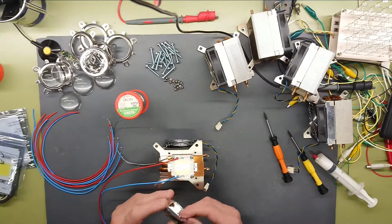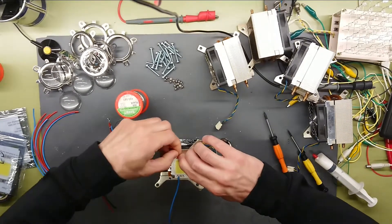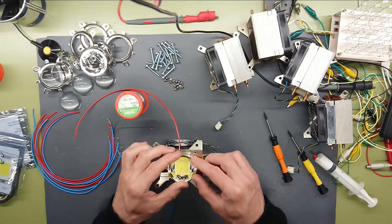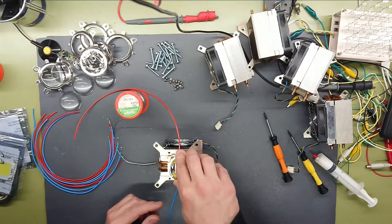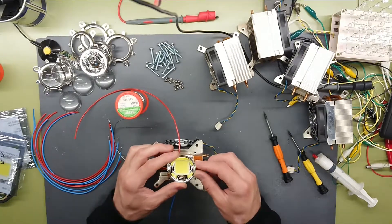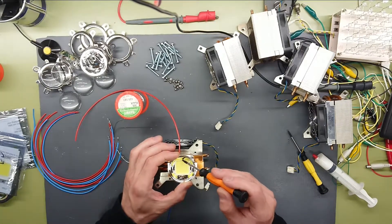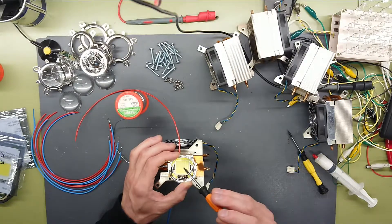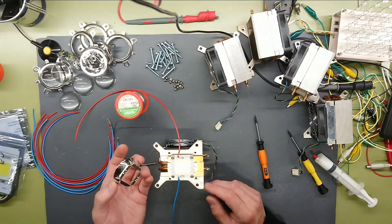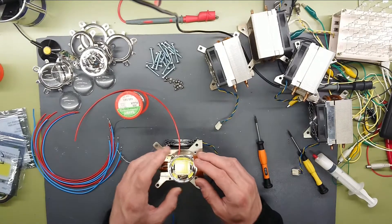Now we can actually place the reflector. We have to get the wires out over the side first — it has four small tabs that go into the holes. Choosing a large gauge wire was not an unconditional success there. I know from videos from other people who have built floodlights from these LED cups that you actually have to cover up some more around the edges, or else you get a yellow glow around the edges of your beam. I will not do that to start with — it was quite easy to remove the lens afterwards, so I'll try this first and see what it looks like, and then go back and remake it if needed.